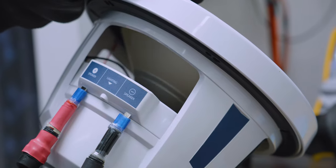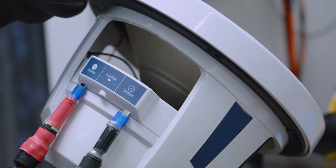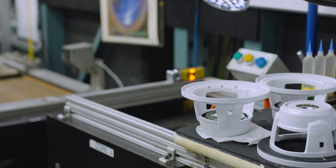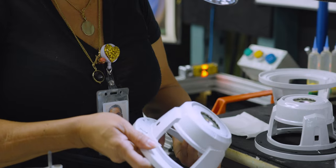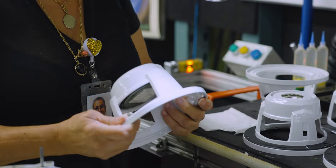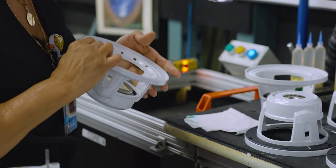The process begins with the motor. The motor is a ferromagnetic alloy that interacts with the voice coil and creates movement using a magnetic field. This is what drives the speaker's movement, which is translated to the pressure waves that we perceive as sound. The uncharged motor is placed inside the basket of the speaker. The basket is the structure of the speaker and houses all of the components inside, hence the name.